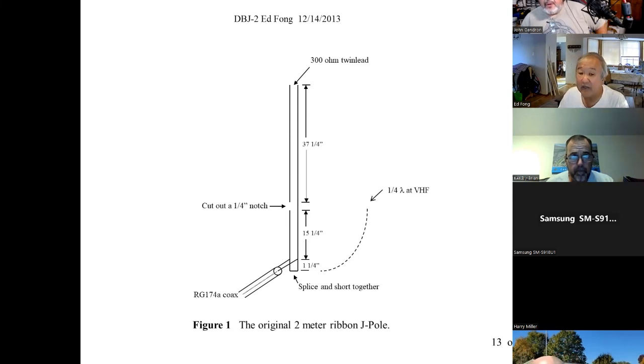That's in air. In twin lead, it's about 10% less, maybe 10 to 15% less. So if you use that, C equals F lambda, the frequency stays the same, but the speed of light slows down. The lambda is going to be smaller. Right? It's about 16.5. It's shrunk about 2 inches if you put it in twin lead. But then still the principle of short circuit, a quarter wave at 2 meters, in this case, it's about 16.5 inches. There's a high impedance.